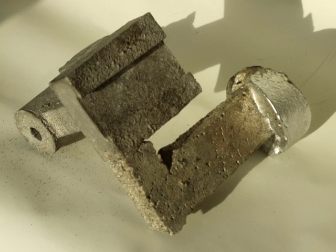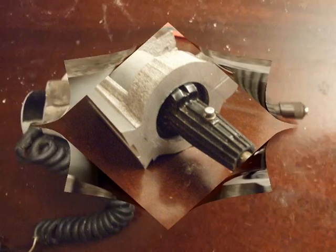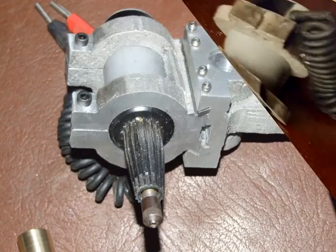A header ring was again used above the sprue. The drill motor mount was bored to a good fit to the drill body and the dovetails machined together with a groove to take the drive rack. The clamping flanges were slotted with a slitting saw and the clamping screw holes were drilled and tapped.